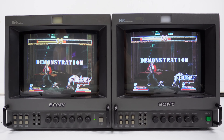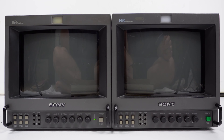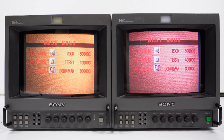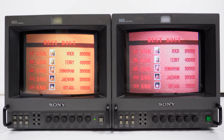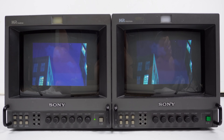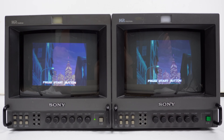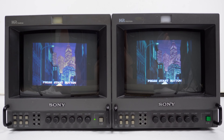This particular model has a lot of bells and whistles — it supports composite, S-Video, RGB, and component. It's not multi-format and won't do 480p, 576p, or upwards. With 450 lines in the tube, it is a quality monitor that will accommodate NTSC and PAL signals.